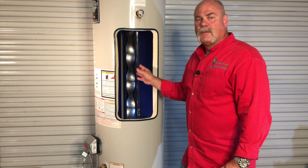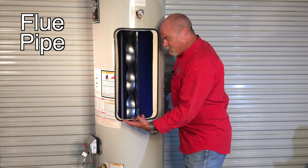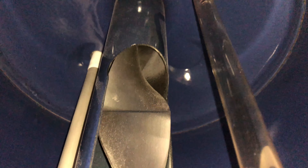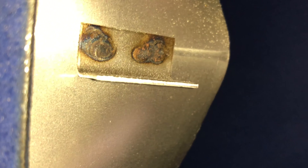On a gas water heater, right here in the middle is your flue pipe. The fire is down below, so your water heater has a tube that goes right up the middle of it — this is where the exhaust fumes come from the burnt gas in the bottom. The way they're designed, that hot gas spins around, and all this material on the inside is surface area used to heat your water, making them more efficient. They've got little paddles built in to actually help force that heat out, making the surface hotter and therefore making your water heat faster.